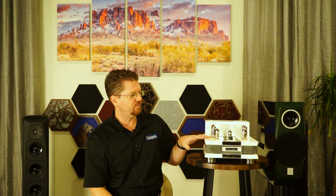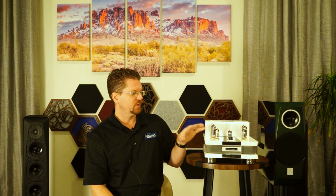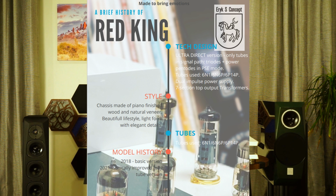But enough of all of that, the heat operation and that expectation. As I had mentioned, it's 12 watts into 8 ohms, and people will think, wow, only 12 watts. I've got the Opera Grand Mezzas, which are 89 dB speakers. The Performance number 1s are 90 dB speakers. And then I have those Alta IOs that are only 87 dB efficient speakers.